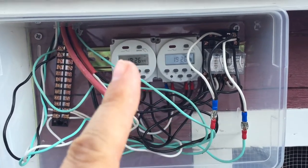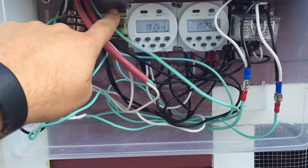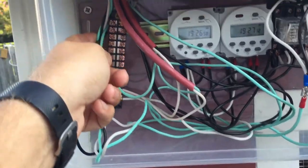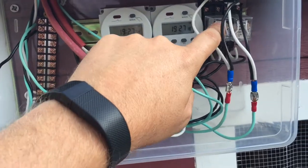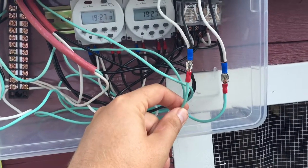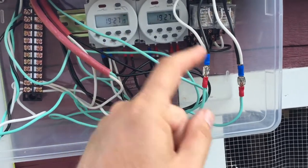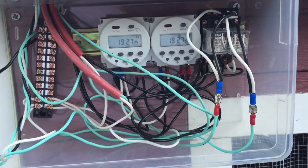Here's my setup. I've got two timers — one on this side which comes on and opens the door, and one on the other side which closes the door. Power comes in from the solar panel and is distributed to the clocks, keeping them powered, and then to the relays that come on or off depending on when power is supplied. The power goes to the motor and it reverses the voltage based on whether it needs to go up or down.